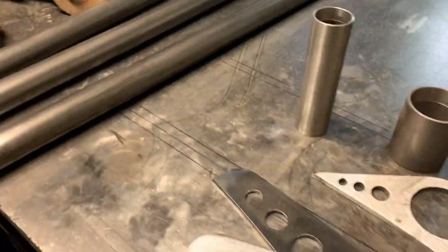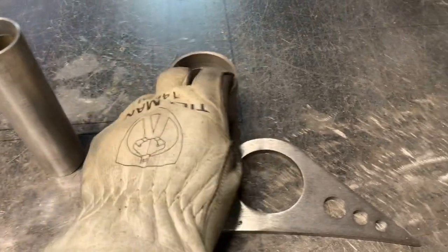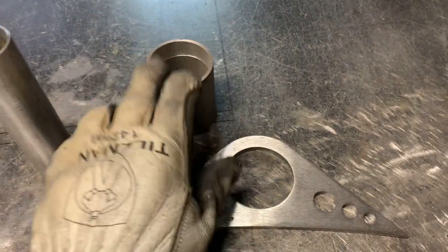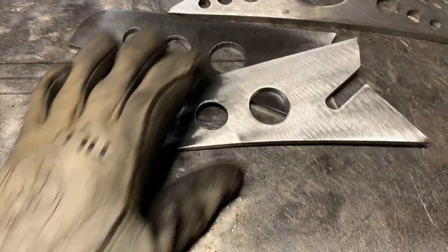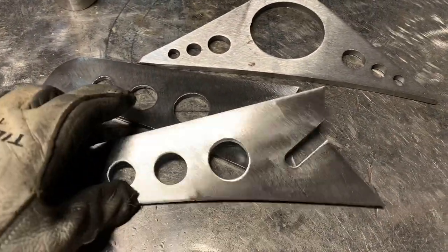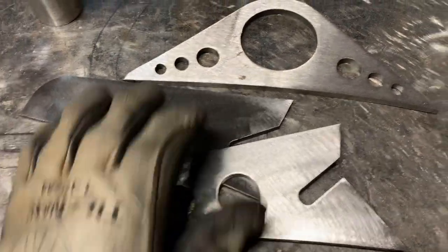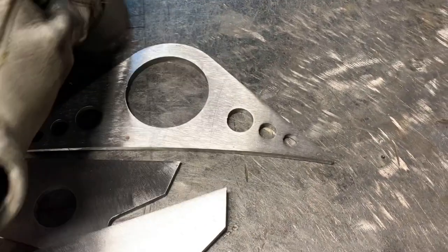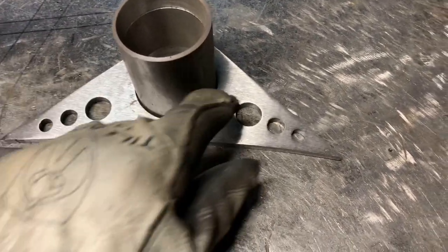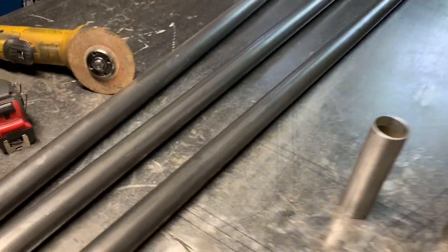And here we have a few necessities on the table. Head tube, bottom bracket, standard 2¾-inch. This particular Reaper is going to be accepting 3-inch wide wheels. Dropouts, I went with the original design of the first generation Reapers. The gusset is slightly different. I had them redesigned to go all the way around the bottom bracket, whereas the early ones pretty much stopped here and here.